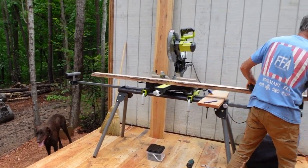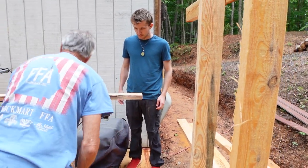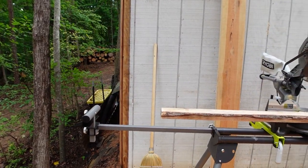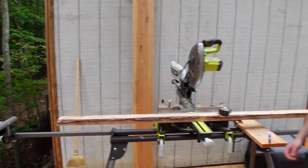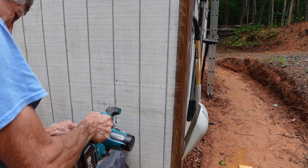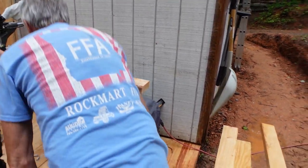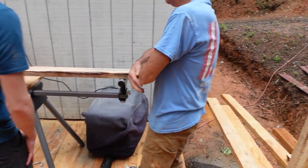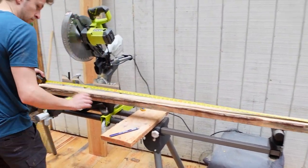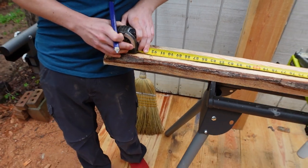Measure from here up 92 and a quarter, and make your mark. You make your mark with a little V. Now we cut it - slide it down. You'll notice the shadow? That's an LED that does that. We've got to make sure it's square up against the fence - it won't be perfectly square, but it's close. Which side of the line do you want to be on? The one that gives you a little more wiggle room. Because you measured exactly, so you want to leave the line. Get your saw started first before you put it in the wood.